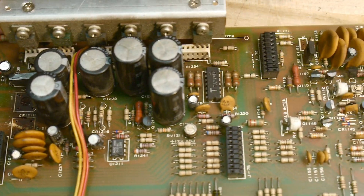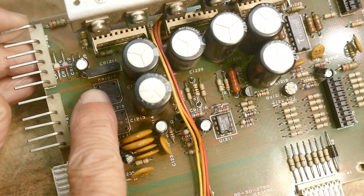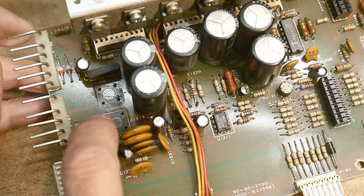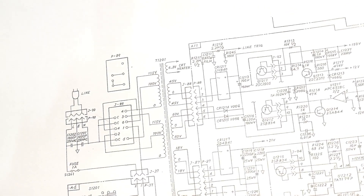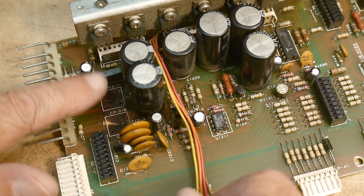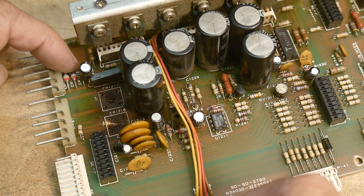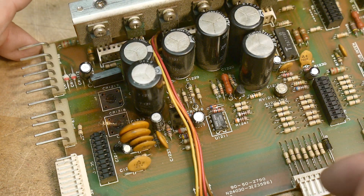Lighting's not great here, but we can take a look. The two bridge rectifiers here, CR1217 and CR1218, are missing. Those are these two here that I previously mentioned. There's another bridge rectifier here, so we'll have to check that one out. And then there are some extra diodes over here — one or two diodes — so check those out. Anyway, these are burnt to a crisp and missing.